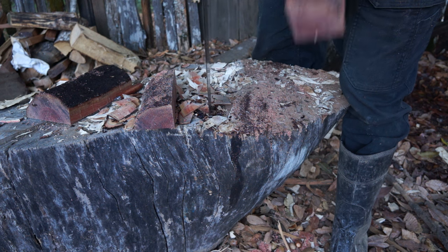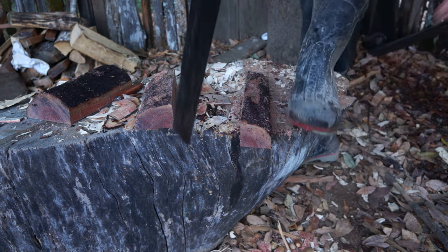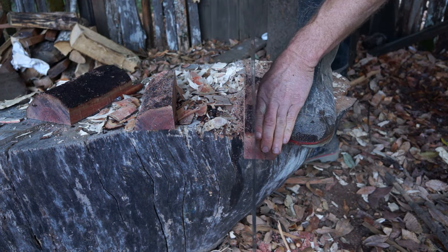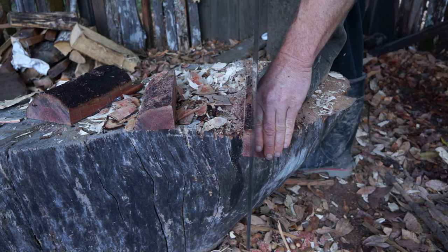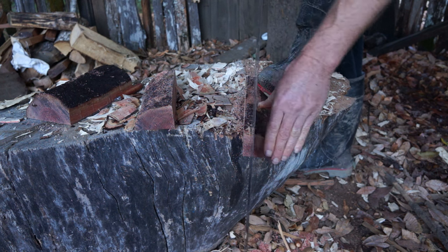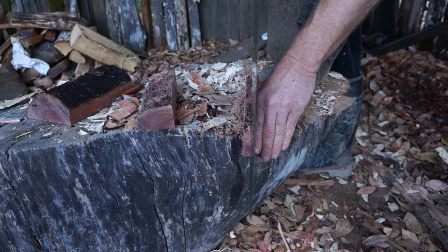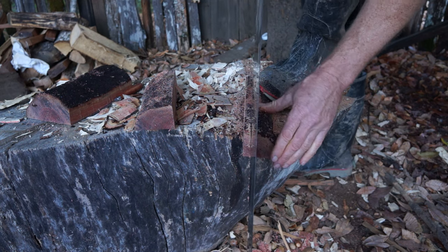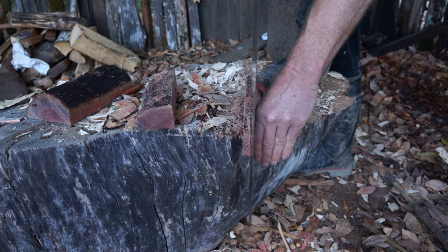Well, I veered off a little there. Not preferable, but not the end of the world either. We're going to take one slab here, maybe around 3/8 of an inch, maybe a little less. Again, because it's going to save me work planing if it's not too thick. But it's going to shrink and it could warp and twist and all kinds of fun things.